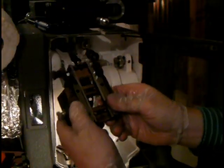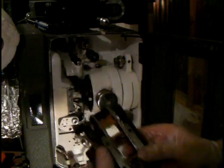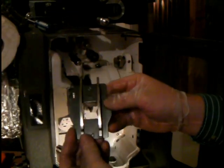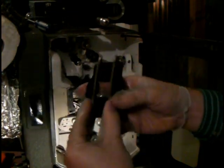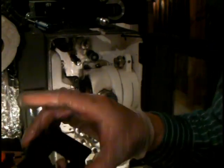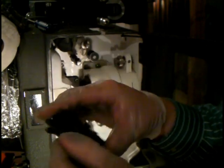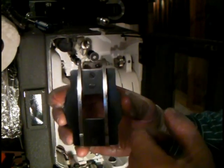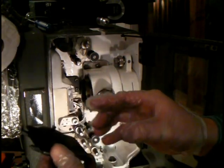Before we put in the unit that holds the aperture plate and has the bands we just went over, we're gonna put in this part that has the little skis that push up against those tension bands. Since the back looks very similar, it's easy to get this flipped upside down, but they've actually stamped 'top' right here so you know which way is up and don't put it in backwards.